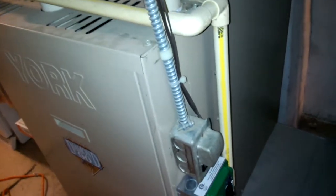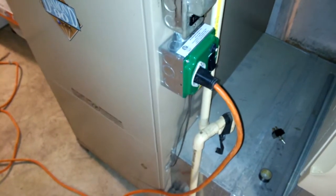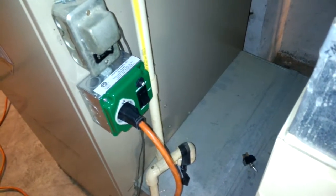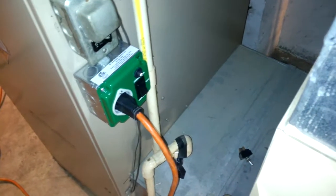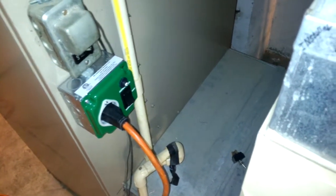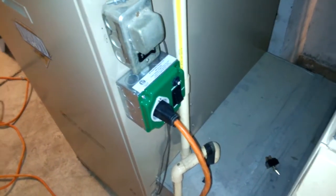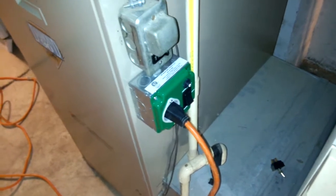As far as a generator, I would think that a good quality 2,000-watt generator would be sufficient. We'll cut in here in a few seconds and I'll show you what the actual numbers were at the 24-hour mark. Then I ran it for a 48-hour mark just to see if day one compared to day two were close to each other as far as total kilowatt hours.